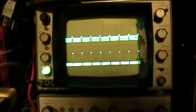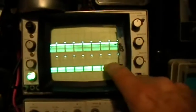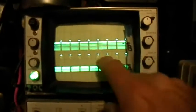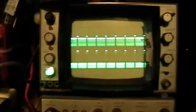So anyhow, I'll pull up the amplitude on the function generator until it peaks. There, I can't get any more positive amplitude out of it because of the clipping effect that's determined by the total voltage of the battery and the voltage drop through the body diodes of the MOSFETs concerned. So here we're clipping at about 7 or about 8 volts, and it just won't go any higher than that no matter how much I crank up the generator. But notice that there's plenty of current well above baseline on those Q1 on periods. Plenty of current indicated.